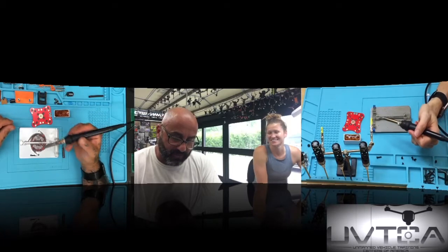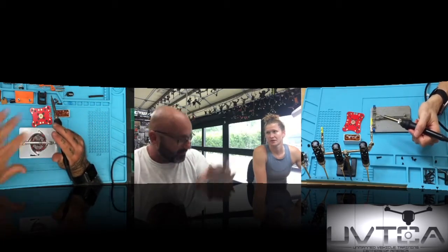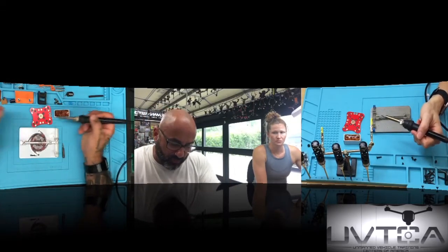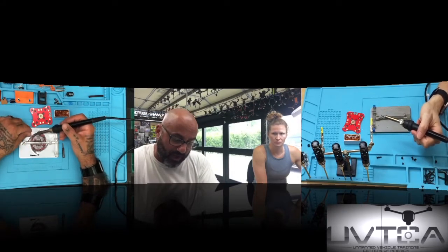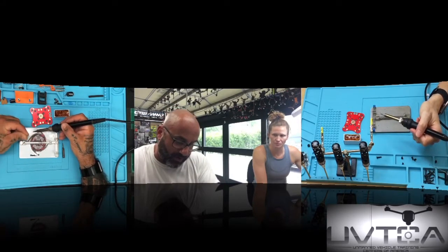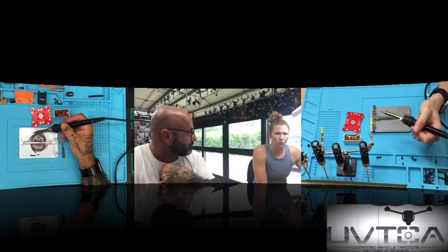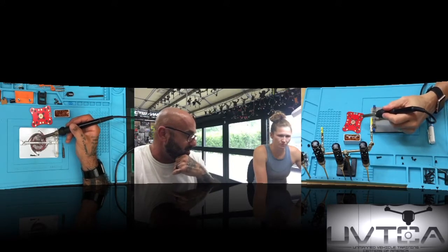Another thing is to make sure that your movements are quick in timing, but slow in removal. What you don't want to do is move quick, because the solder will flick. It will fly off. If you have a wire on there and you lift that wire and pop it, that solder's still hot, it'll pop off and fly.